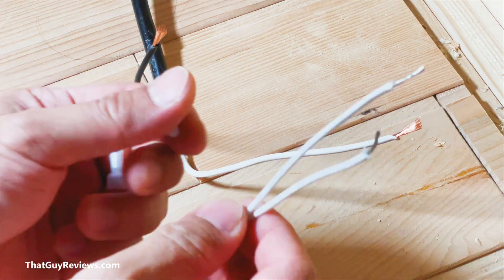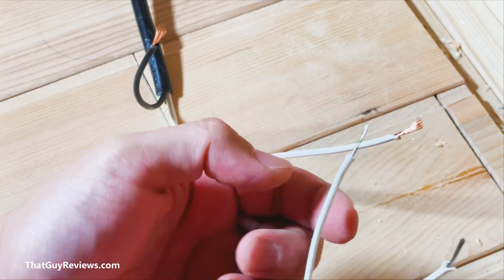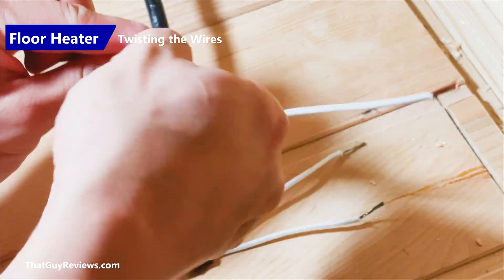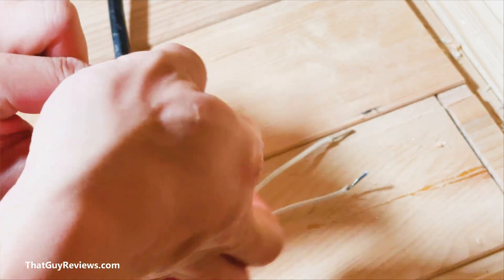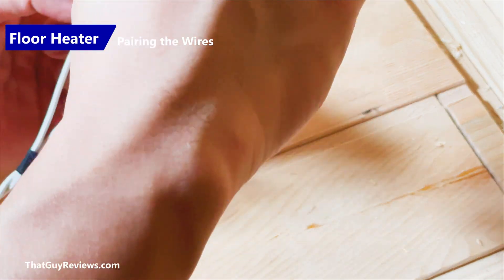For the bottom pieces they have less wiring — it's only going to be two wires, so we use a smaller cap for each of these. I'll twist the wire so it's tight, same for this side, then I'll pair them up, twist them, and put them inside the cap.